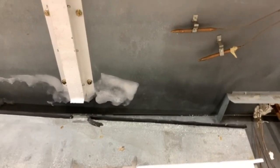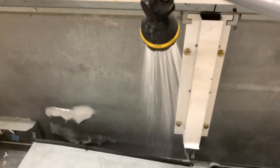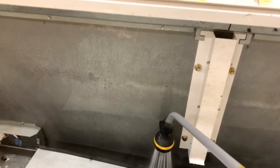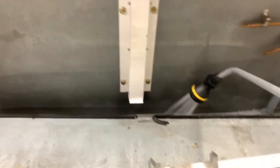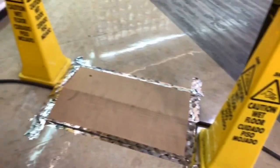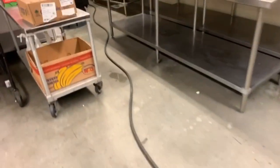When you're de-icing, just make sure you pull the back walls off these frozen tub cases because they build up ice on the back wall. A lot of people don't see it — they leave it and it just keeps building. It creates a lot of headaches. So when you're de-icing these tub cases — close and shut cases — take the back walls off to get whatever ice is built up in the back. It's easier to run the hose and get unlimited hot water versus having to fill trash cans up every time, if you have access to a nearby water source like this.